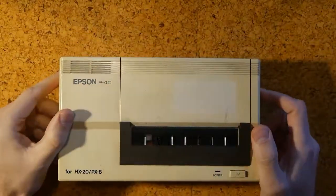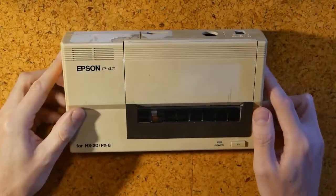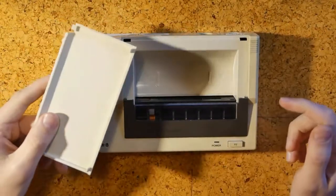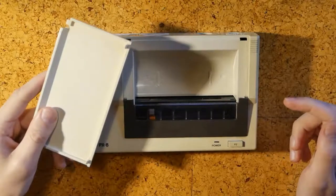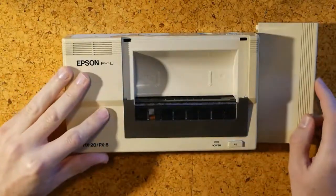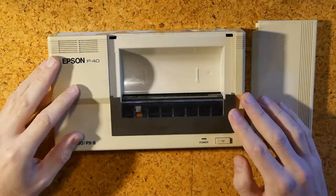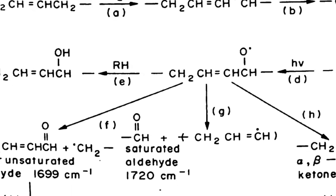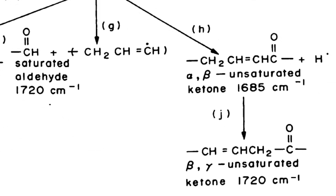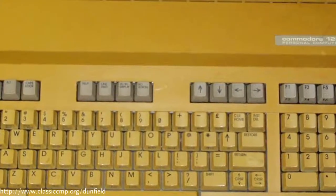This is because it's been left out in the sun and ultraviolet light has attacked it. Anywhere that light could reach has gone brown. The inside and bottom are still relatively white, but anywhere where there was a label becomes really obvious. The chemistry behind the yellowing plastic is complicated, but it's mostly due to ultraviolet light attacking the bromine-based fire retardants in the plastic, which causes them to degrade and turn brown.